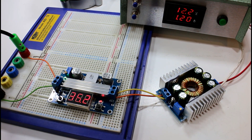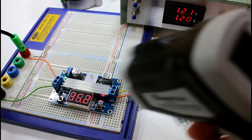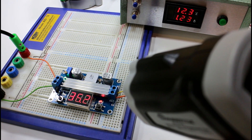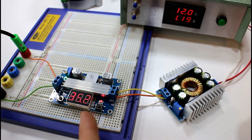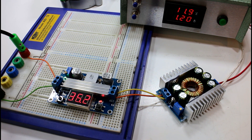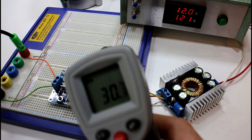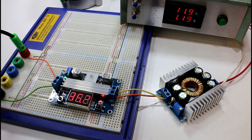It's been running for a few minutes now. Let me show you the temperature of the table, then the heatsink on the step-up module, and then the heatsink on the step-down module. It looks like the step-up module is generating a lot more heat than the step-down module. We've been drawing somewhere between 1 and 2 amps for about 5 minutes and there's not a huge temperature rise.